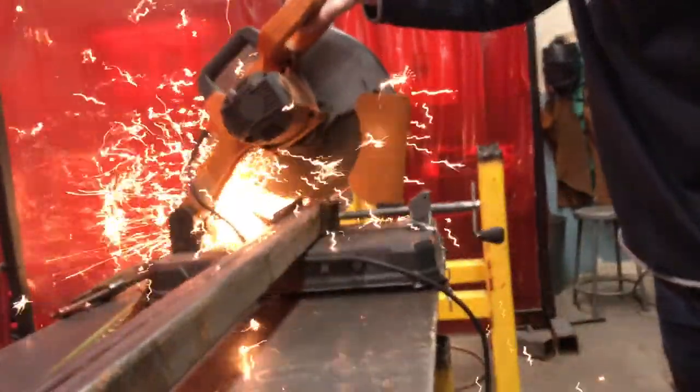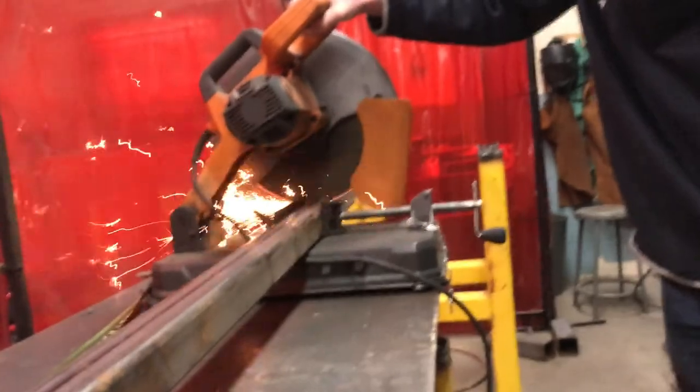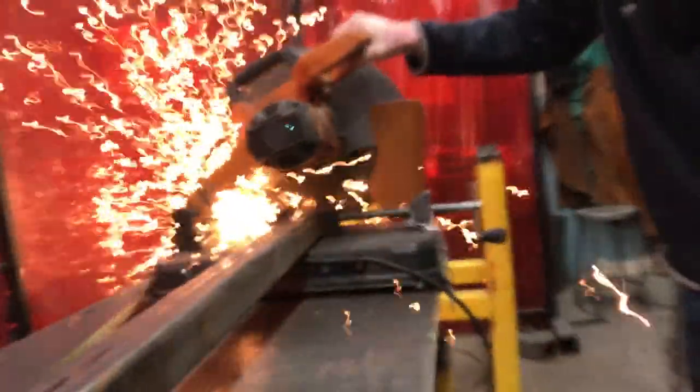First, we'll cut off a 1-foot section of 2-inch square tubing. This is what will go into the truck and what we'll mount everything to. Next, we'll drill 2 holes. The first will be for the pin to hold it to the truck, and the second will be to hold the clevis.